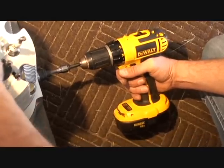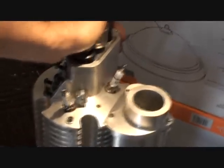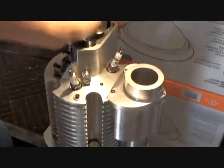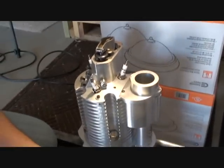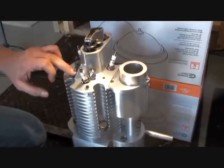I have to take some relief off the exhaust valve because it's creating so much pressure, but you can see the exhaust valve moving, opening and closing. I didn't let the exhaust valve close all the way — we just wanted to show the reed valve functioning and pumping air through the system.